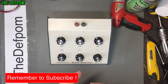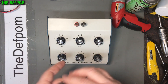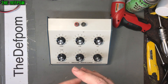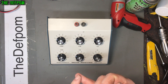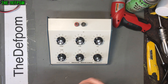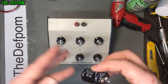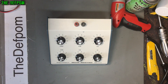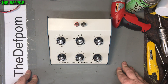It might just say the capacitance is okay - but when you stick a high voltage across it, it shorts out, and you don't want that. I've been thinking about it for the last few days. I was going to use op-amps to do some current biasing checks, but I'm pretty sure I can do a whole lot with the Arduino for the measurement side - current measurement, voltage measurement. That'll probably be in a later video. I've got a lot on already, so it'll take some investment and time to design. I'll need to breadboard it up and do some testing first to be sure I can make it work.